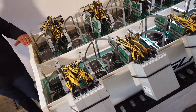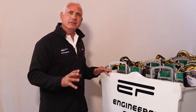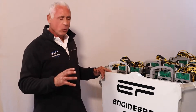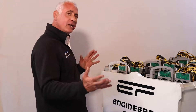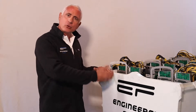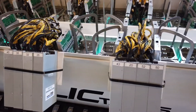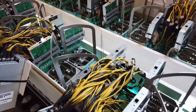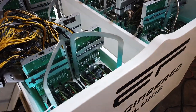The other thing that's unique about the tank is because of the resin material we've used — fiberglass resin has a very low heat coefficient, which means it does not transmit heat very easily. The heat stays in the tank, unlike aluminum or steel, which radiate all of that heat outside into your environment. With this resin material, we're able to get more than 98% of the heat back into the fluid and outside of your mine, which is absolutely critical to minimizing the amount of comfort cooling that you need inside a large mining facility.